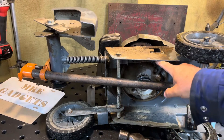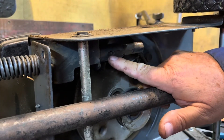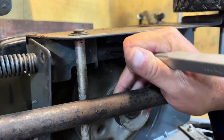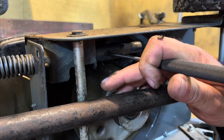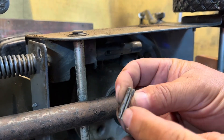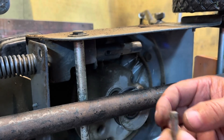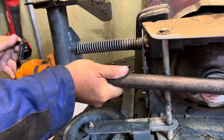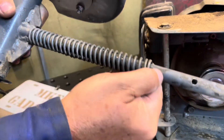I had to bring a pipe clamp in to release the pressure on that pin — hopefully I can drive it out now. I'm changing this punch; it's about the same diameter as that pin. So this was a split roll pin that was in there, and when it's compressed into the hole it expands, so those two parts don't come apart very easily. If I release this clamp, the whole assembly should come out — and it is. There's the hole where the pin was.